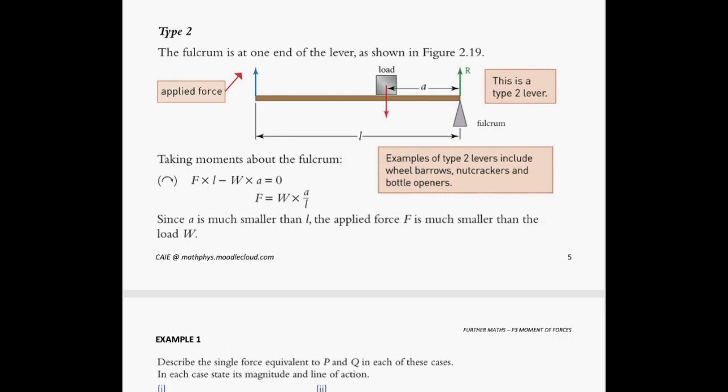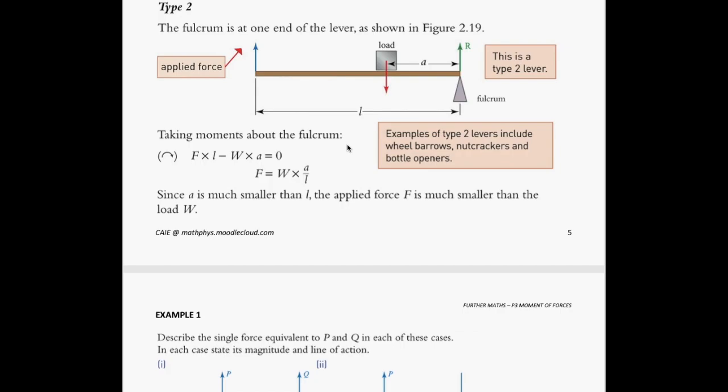Type 2 lever. You can also have a second type of lever that works in such a way where the fulcrum is placed at the end, you have a load here, and then the force applied is given by F. By going through the same principle of moment — the resultant moment must be equal to zero — we find the corresponding equation. The advantage of using lever type 2 is that the distance A is much smaller than L. Therefore the force that you need to apply is much smaller than the load that you are trying to lift up. This is a very good physics and mathematical strategy to actually lift a very heavy weight.